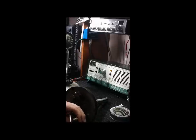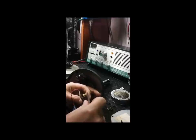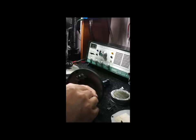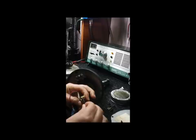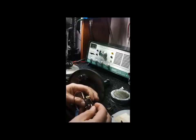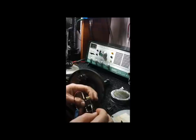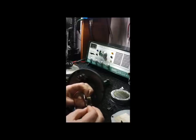All it does is press down, so really it's making contact with a number of different contacts. I'm going to take the bottom one first, push down — you don't want to get rough. I'm just wanting to get the black tarnish off of them because his microphone — I'm going up to the next one in between and pressing down — his microphone was breaking up extremely, extremely badly. It started out not bad at all, just a little crackly, a little staticky at times. Then there's a third one. I went from bottom to top — it doesn't really matter. We just want to get the black corrosion off.